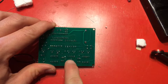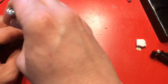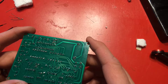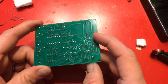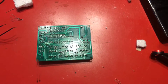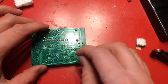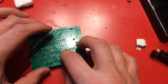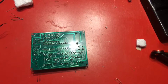After a little bit of looking around, I found another jumper point that I missed, but I've already put this in. I could try to take it out — I do have a desoldering kit — but instead what I'm going to do is lay this piece of wire over the top of it. Since the green board is covered in a plastic coating, it should be okay, and I'll just solder it in place. I need to plug my soldering iron back in.